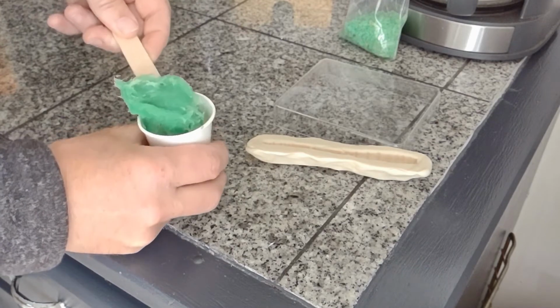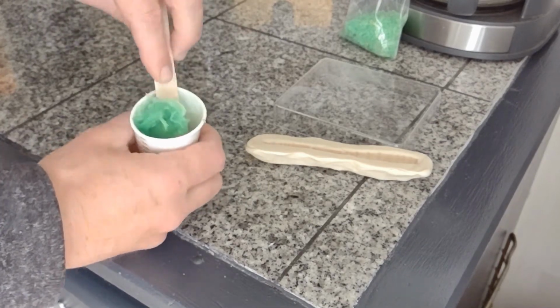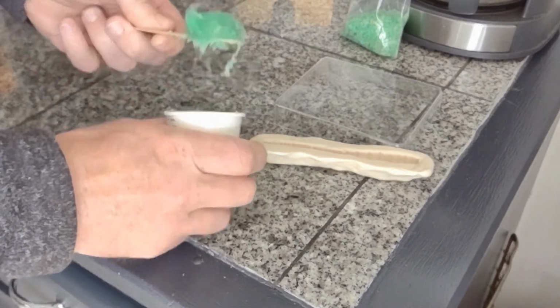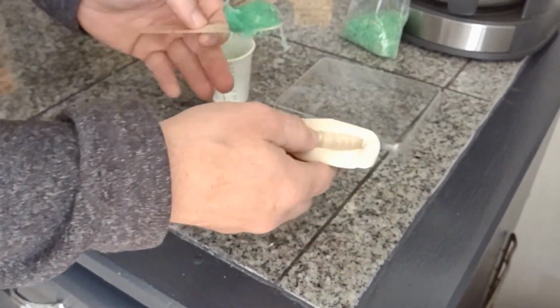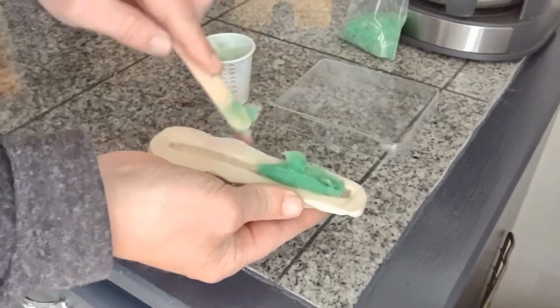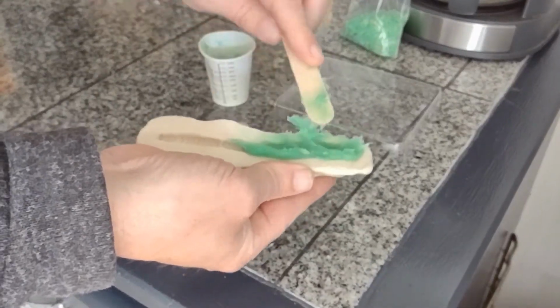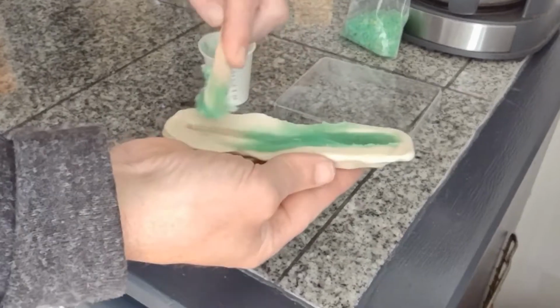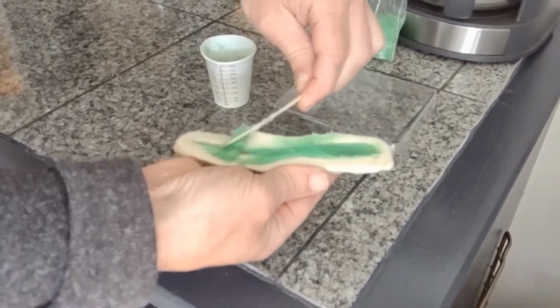After it's mixed, make sure the temperature of the rubber isn't too hot to touch and spread it into the ImPRESSive Putty mold cavity. Experiment with different techniques for spreading into the mold cavity. You can get really fast at this. I like to start by filling up most of it and then coming back and spreading the rubber more carefully. After it is cooled, I can even use my finger to clean up the edges a bit.